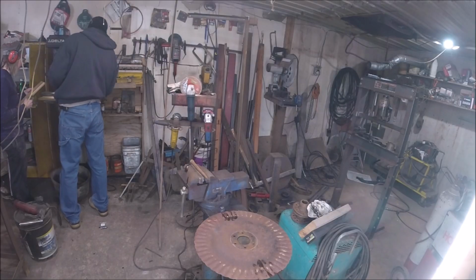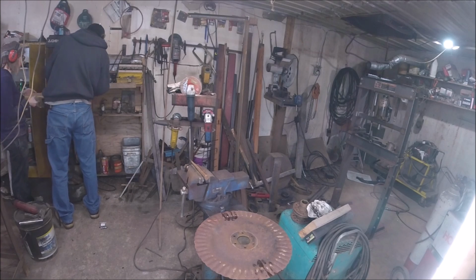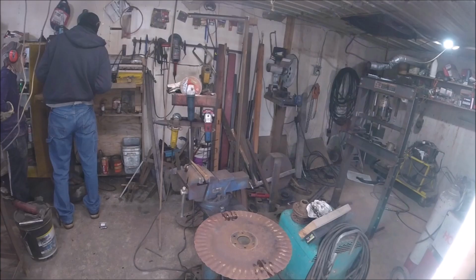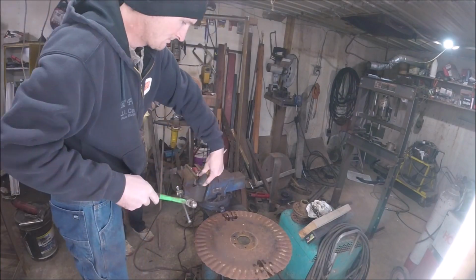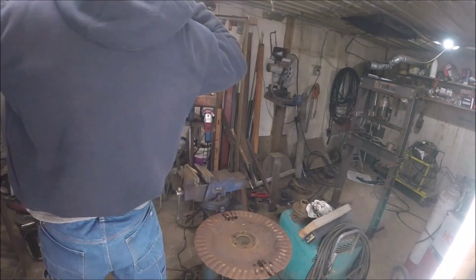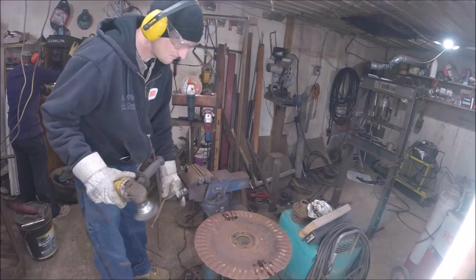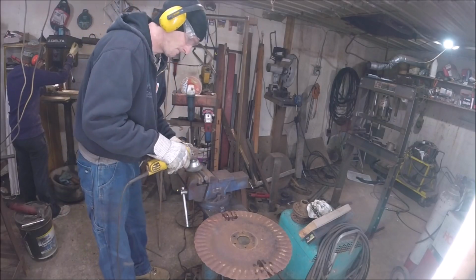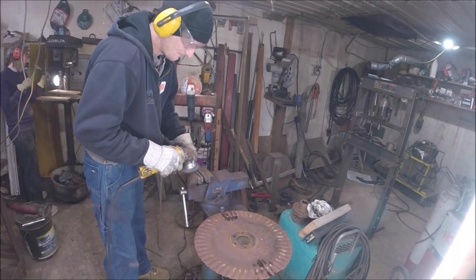For the hardware, again, there's 6 3/8 bolts that go through the hubs for the coulters. So with 2 bottoms, or 2 coulters, that's 12 bolts. I'm going to get all new for that. The actual bolts that go through the entire yoke assembly and the spindle are 1/2 inch, and I'd say they're probably 6 inches long. I'm going to take them all in with me when I get new ones. They're fine thread.